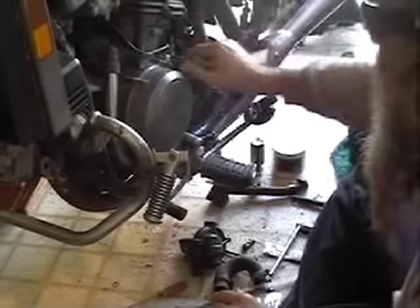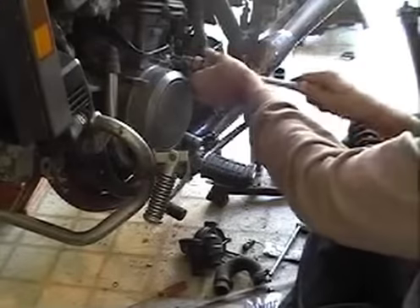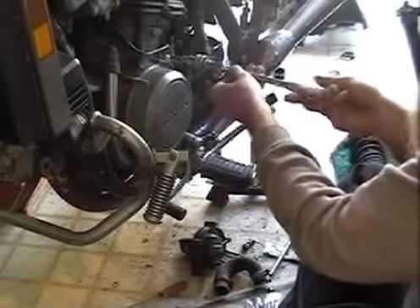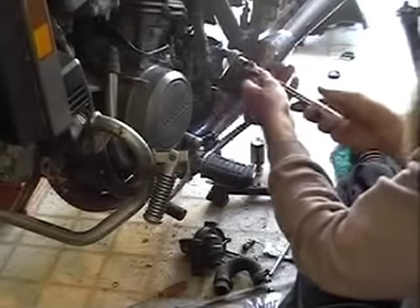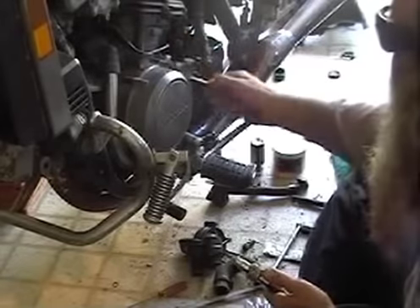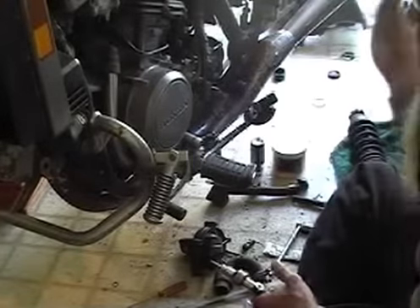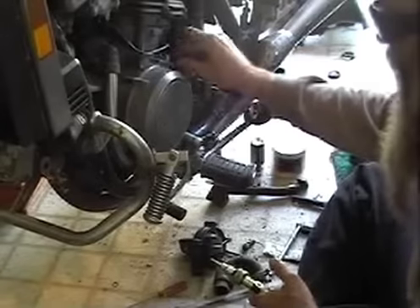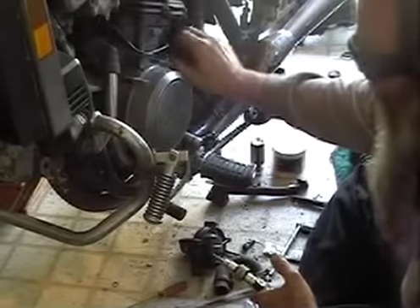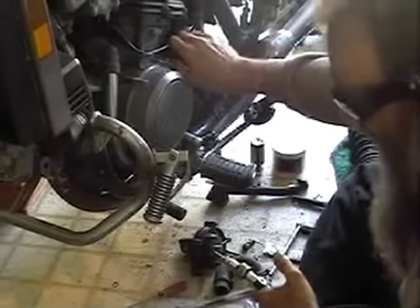What I'll do on this one — it's going to be a pain in the ass because it's still got all that old crusty shit in there from being factory. To get that crusty shit out, I run one in like this, and if I hear it squeaking, I'll reach back behind me to this pan of diesel that we use for unsticking engines. I'll rinse it as many times as I need to so that the dirt and crap sticks to that bolt and I can get it out of that hole without having to run a tap in there, because running taps can mess up some threads and that can get expensive.